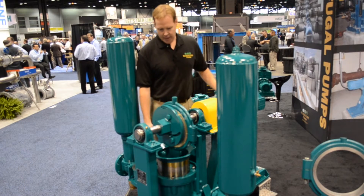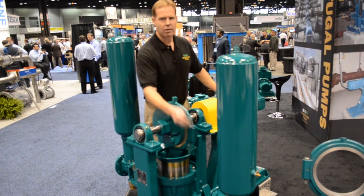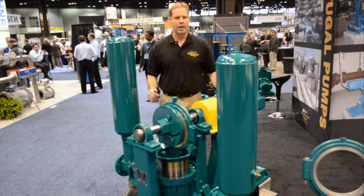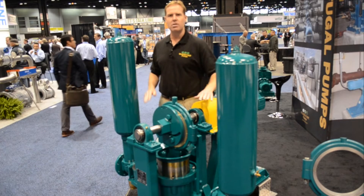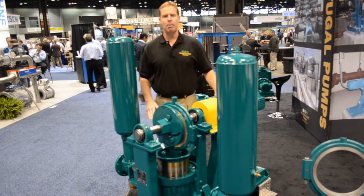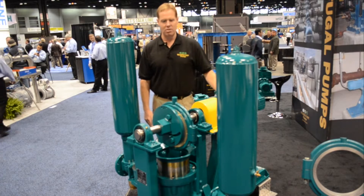The basic design of this pump uses a ball check system. Suction is on the lower side and discharge is on the higher side. These pulsation dampeners, or air chambers, are designed to primarily dampen any pulsation or water hammer in the pumping system.